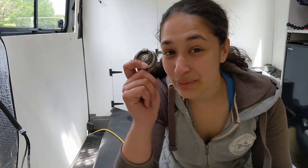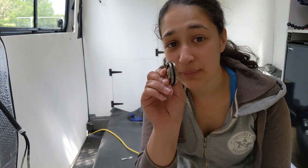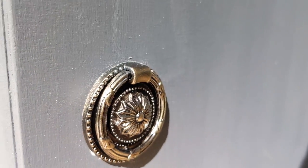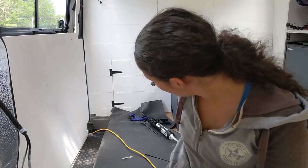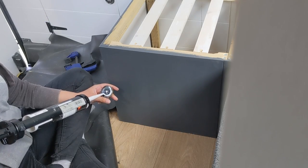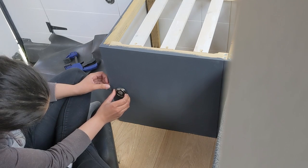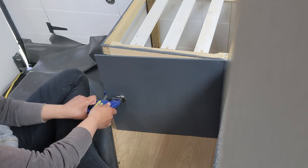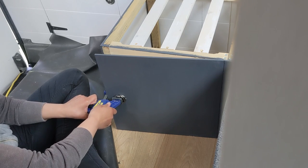What I've got here is one of the handles we're going to be using on most of our low-level furniture cupboards. They're nice and flush fitting so we're not going to kick them or hurt ourselves on them. I've already got one on that cupboard door there. The way we're attaching these — they did come with bolts, but the bolts are either way too big or way too short for our doors, so rather than buy new bolts we're using Sikaflex. Seems to be working pretty well.